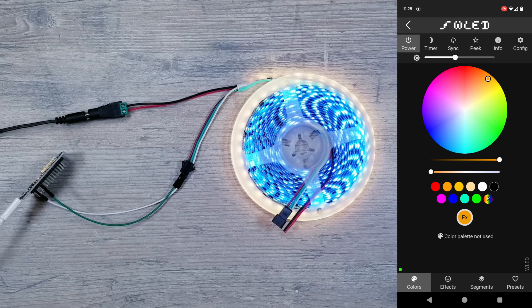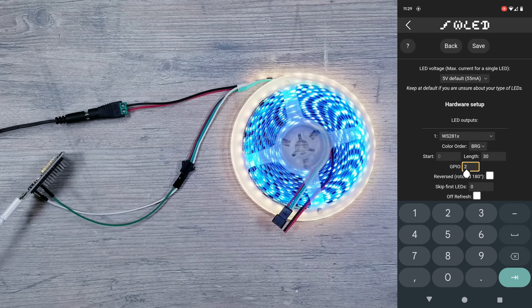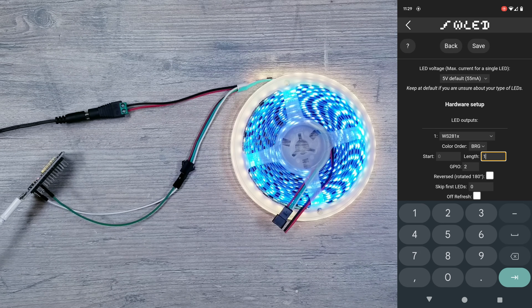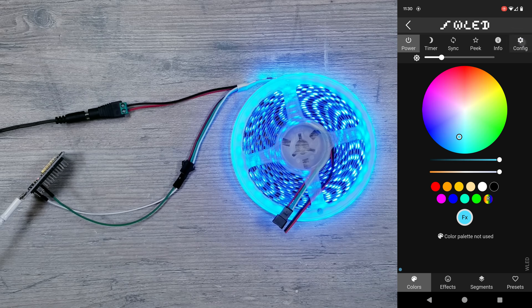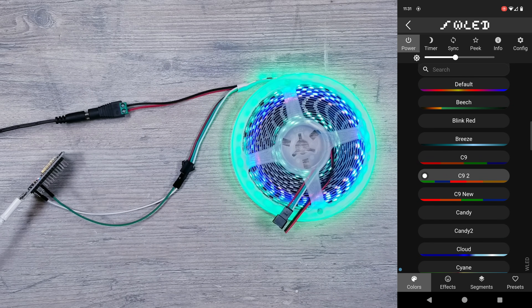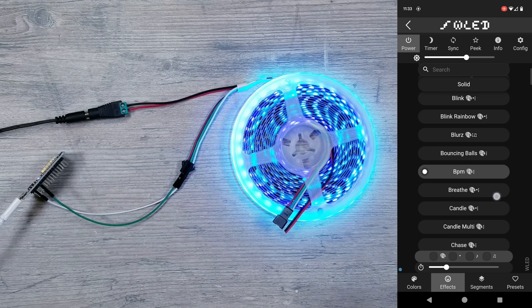Once you have things plugged in, go into the WLED app and configure LED preferences. Scroll down and first make sure you have WS281X selected. Also make sure GPIO is set to 2 since that's the pin we used for data. For the length, we know there are 96 LEDs per meter and 5 meters, giving us 480 lights total. They're controlled in groups of 3, so divide 480 by 3 which gives us 160 — put that into the length field. You should now be able to control the lights as expected. If colors are off, go back into LED preferences and try different color orders until red shows red, green shows green, and blue shows blue. BRG was the order that worked for mine. Also, don't run your LEDs for very long if they're rolled up — things will get hot fast when stacked on top of each other, so unroll them after a minute or two of testing.